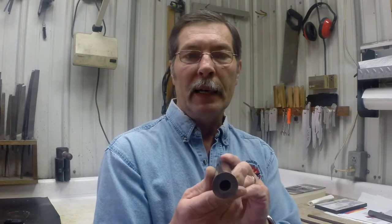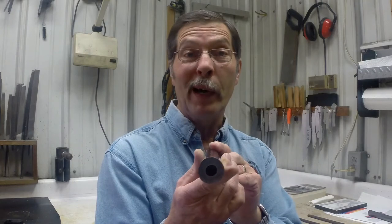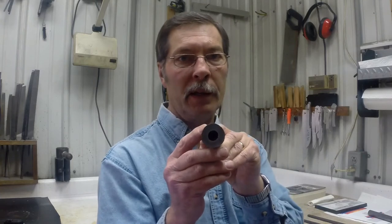When drilling one of these tubes out, you've got to take a significant amount of material out to straighten out the hole, to get the ugliness out of it, cut out all the unclosed welds, the open welds inside of it, and get out into the Damascus far enough that you're into solid Damascus material. So you really have to push these down a lot smaller. For a 45 caliber barrel, I forged the bore down to 1/8 of an inch and then drilled it back out to 45 caliber. I'm going to be trying to do a similar thing to this.